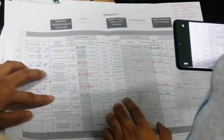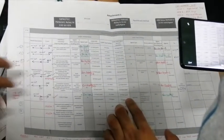So we'll also show you the input outputs of this. So we are getting this signal, 11 kV earth switch close permission, from the 132 kV relay, and it is coming to the Siprotec relay, and the Siprotec relay outputs this signal on BO5, and it comes on the ABB relay X20 BI4. So let's show this.